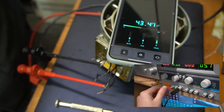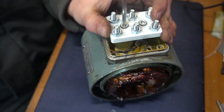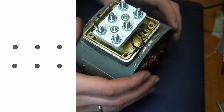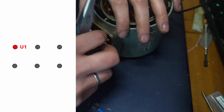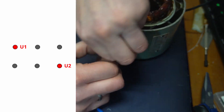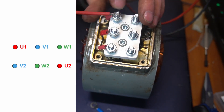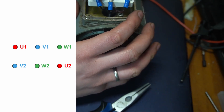By reversing the polarity we can see the measurement is quite different. I 3D printed a new terminal block and connected the wires like this. First I measured which wires belonged to which spool. Then I picked one wire randomly and mounted it to the terminal block — this will from now on be called U1. The spool's second wire is also mounted to the terminal block as shown. For the next two spools, I checked polarity by applying voltage and then connected them, till they were all connected in the shown pattern. This makes it more convenient to connect the motor in star or triangle configuration later.